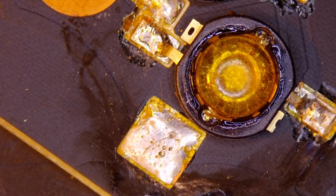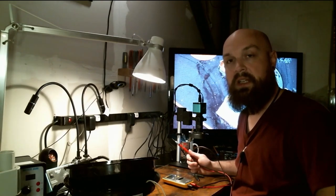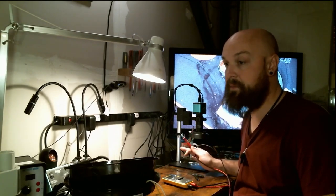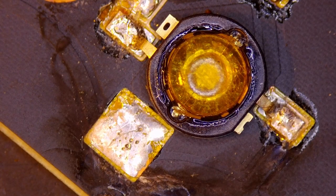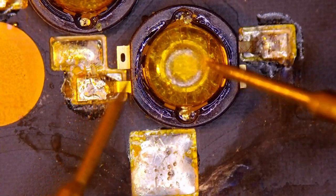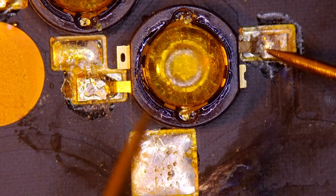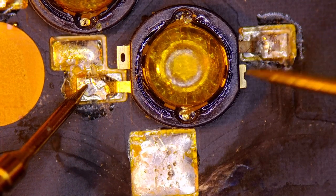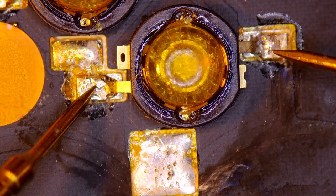The best thing to do when doing this kind of work is take a physical look at the board, see if you see anything major, and then dive into it. For the purpose of this video we're going to get right into testing, because all I can see right now is a burn mark on the board. I'm going to put my meter into diode mode, and the first thing we're going to do is check to see if these LEDs are good. So we have our first component right here — this is our LED and these are our contacts. By putting our meter into diode mode we're able to send a small voltage through this LED to see if it lights up.